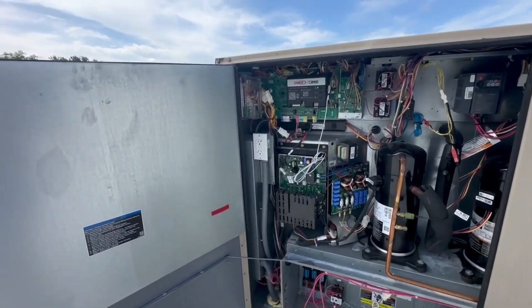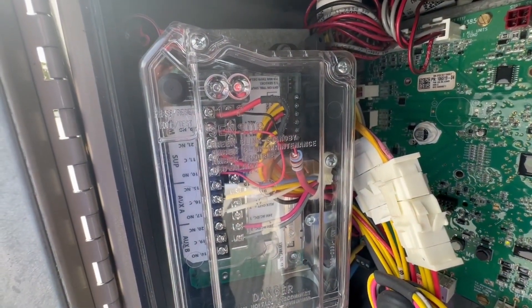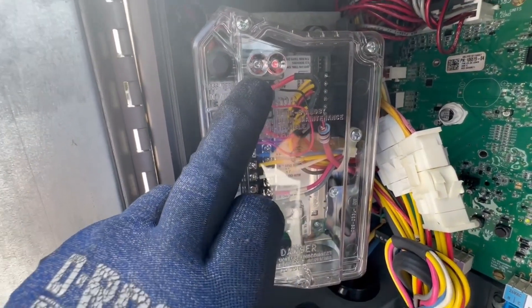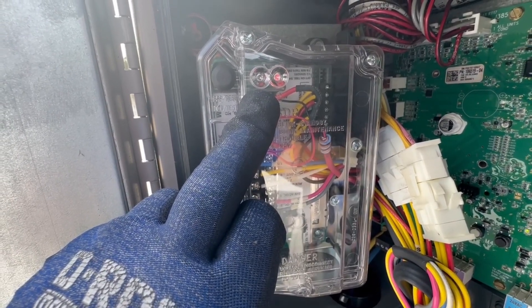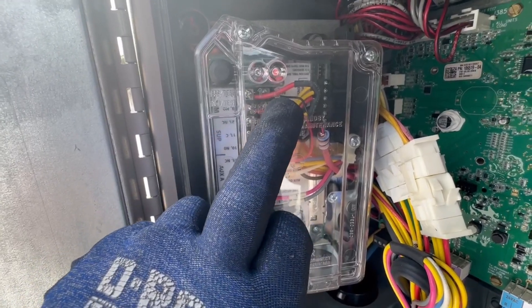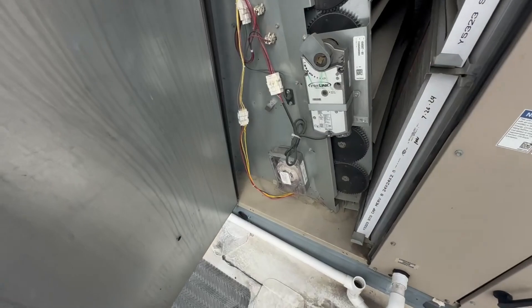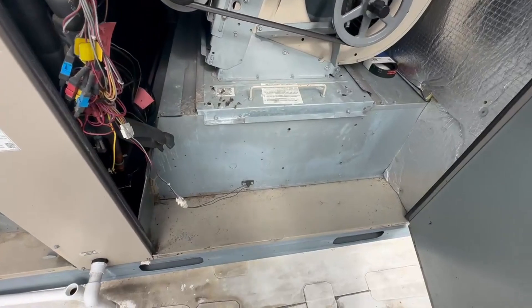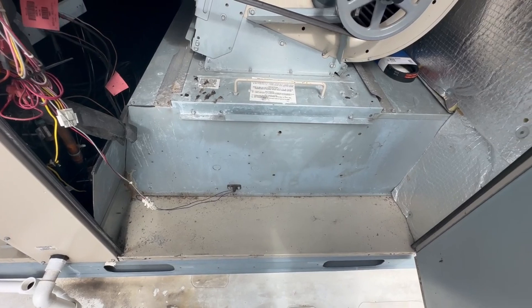After looking, I found that the sensor in trouble is sensor two. You can hook two sensors to these units — sensor one is flashing green, it's kind of hard to see when it flashes. There is no sensor two in this unit; sensor two is usually for the supply, but in these particular units they didn't put one in the supply, just in the return — that's sensor one. Usually the second sensor is down in this area, which they do not have on this particular model.